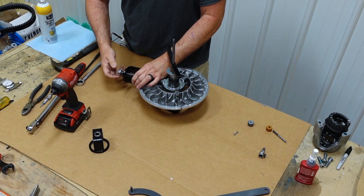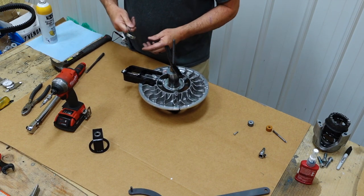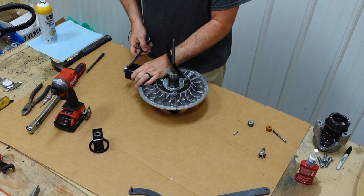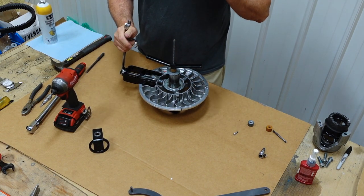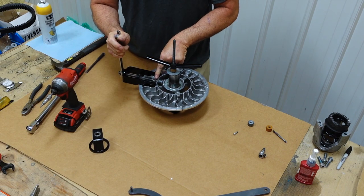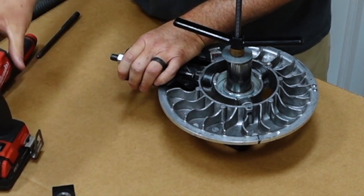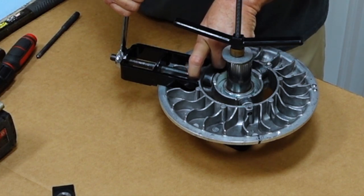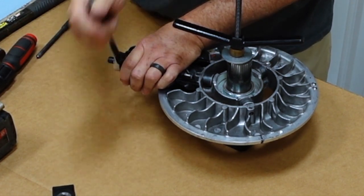Put on the washer and the nut. Use a 3/4-inch ratchet wrench — make sure you're going in the right direction. That pin is coming right on out. You can literally do it one-handed, though it's a good idea to keep one hand on it. Sometimes you have to put a little heat on — use a small torch right in the area where the pin is. And of course, if you're pulling out a roller you're replacing, it doesn't matter if you damage it.